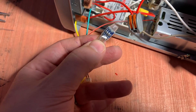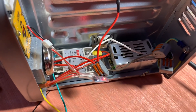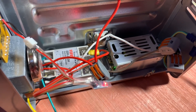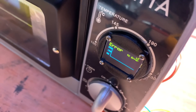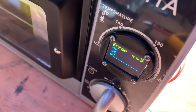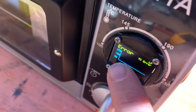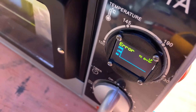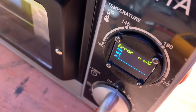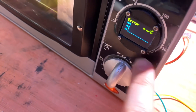Not enough hands to turn this on on camera, but we can see the LED there for 5 volts, the LED on here for 3.3 volts, and round the front the OLED is on with an error - it says TC error, thermocouple error. Well that's correct, I haven't got one attached. As you can see, this is a two-tone screen: the top section is yellow and the bottom section is blue. You can see it's going to have a graph when I actually do a reflow, presumably showing the temperature and some other information. LF stands for lead free - that's the profile - but I need to use leaded, and to do that I need to get the buttons in the case.